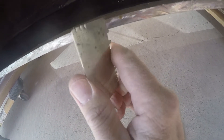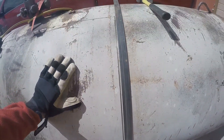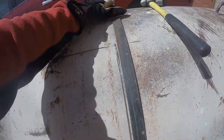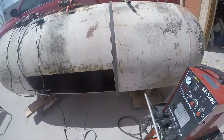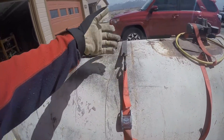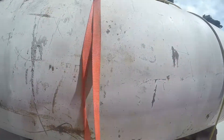It's every bit of 5/16ths. I stole this idea from a guy on YouTube — Smoker Builder — and this is how he runs his plasma cutter for a nice easy edge. I just drilled a couple holes in the end of this — this is just 1/8th by 1 strap — and we'll run the plasma cutter along this edge to get a nice straight cut. I thought I'd need to bend it, but just putting the strap on and tightening it bent it naturally, so it actually worked out pretty well.